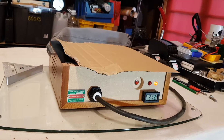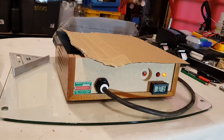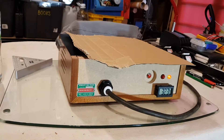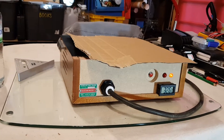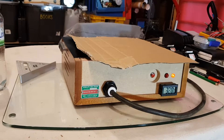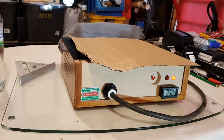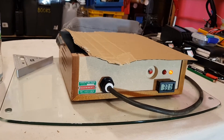Just a quick note about power factor. Power factor is a measure of how much the current lags the voltage in an inductive load — a good switch-mode power supply might be 80 or 90 percent. I measured the current on this thing: it's 15 amps, which is actually a little bit over the 13-amp mains plug rating. The fuse doesn't blow immediately if you're just a little over — it just gets warm and might blow eventually. So: 15 amps at about 260 watts, which means its power factor is around 0.1, which is shockingly bad — I've never seen anything with such a low power factor.